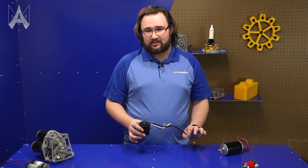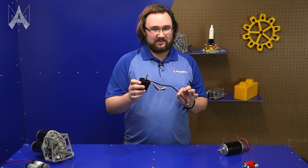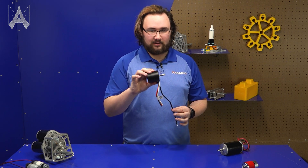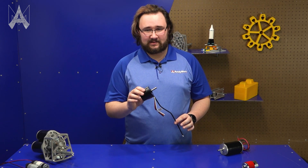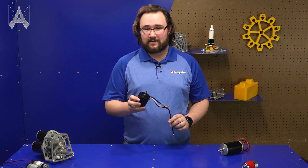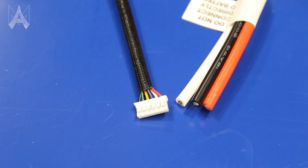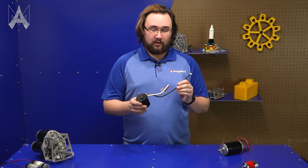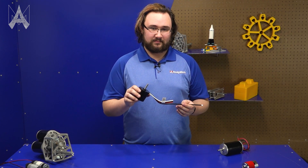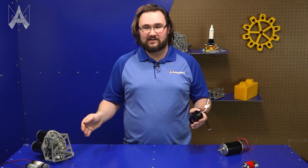In the last few years, teams have been switching out their CIM motors for full-sized NEO motors. It has similar, if not almost exactly the same performance as a CIM motor, but in a much smaller and lighter package. Its power delivery is a little bit better than a CIM motor, especially when warm. However, this full-sized NEO is a brushless motor and requires a special motor controller to use — the SparkMax motor controller. Note that there are several cables that need to be plugged into the SparkMax for this motor to work: three phase wires and the encoder cable. All four cables need to be plugged in for this to be a functional motor. The rest of the motors on this table are all brushed motors, which can use much simpler controllers with fewer wires connecting to the motor.